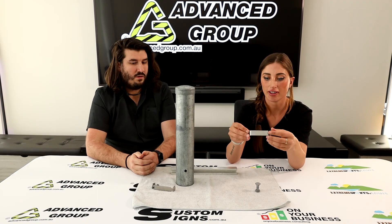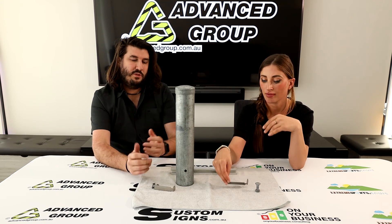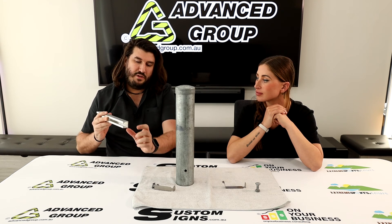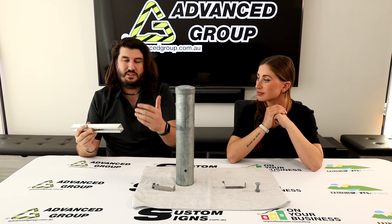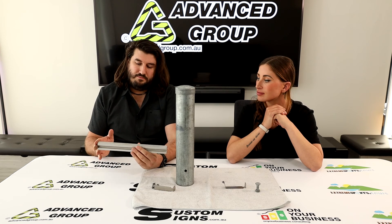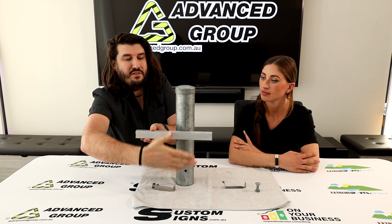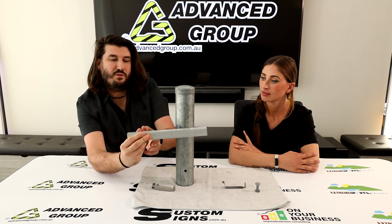Would anyone change the colour of these for any reason? No — these are almost virtually hidden. When you make a sign with strut channel bracing, you'd normally end the bracing maybe one or two inches shy of the edge of the sign, so you can't really see it unless you're peeking in. With the channels so far in from the sides of the sign, the face of the sign completely covers the strut channel — it's only from the side that you would see it.